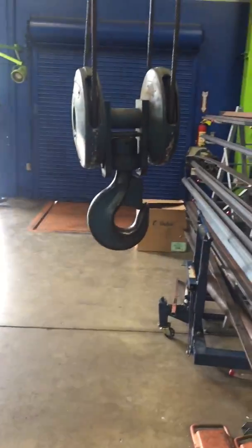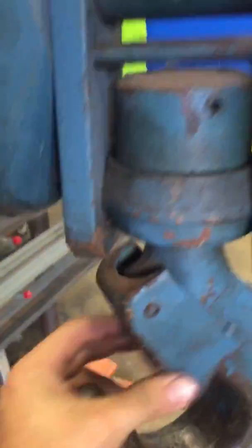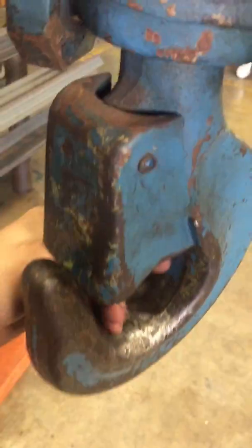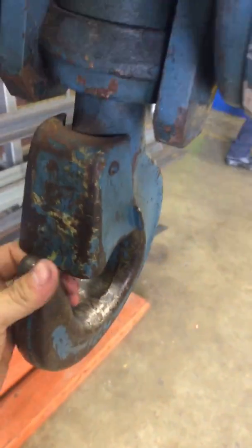So now you bring this thing down low enough where we need to hook something up. You hook it up right here — this is our drum right here. We've got these safety guides so that the cable cannot pop out. We've got another safety device right here: if this piece was not here, we would not be able to operate this. Once something is hooked in here, it will not slip out.